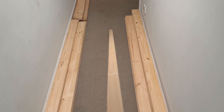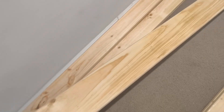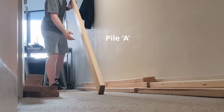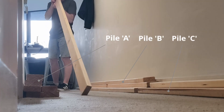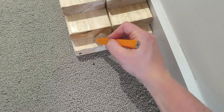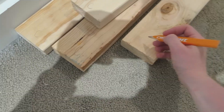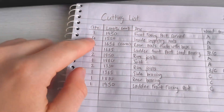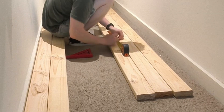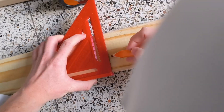Before cutting anything, I checked every single board. I'm looking for warping, checking the end grain and keeping an eye out for big knots or damage. Once that's done, I sorted everything into 3 piles. A is the best timber going to be used for structural parts and C is the worst quality but should be used for non-critical and hidden pieces. I then marked each board A, B or C so I know exactly where it's going to be used later. The A grade boards are reserved for the leg posts and rim joists as they are structurally important. I then marked the lengths on each board in pencil and used a square to draw the lines where I'm going to be cutting the wood.